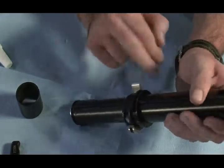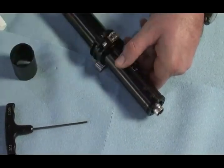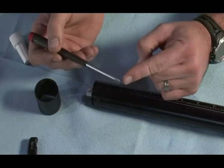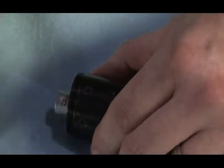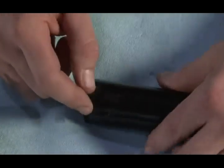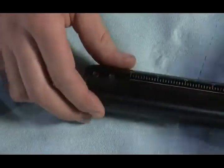Make sure there's no play between this set screw, this set screw, and the inner post. The next thing we're going to talk about are these little radial screws — and these little radial screws. This is the inner post; this is the outer post. You will need a Phillips head screwdriver, and this little thing goes in here. If you get play in this position right here — you can do it with the donkey box on, with your upper junction box on, whatever — you need to make sure that all of these screws are tight. There are nine of them. Not six, not seven — there are nine. Same on this end: there are nine set screws, so you need to tighten nine screws. If you do that, you'll keep the play out of this point and out of this point.